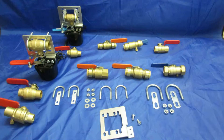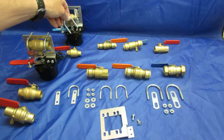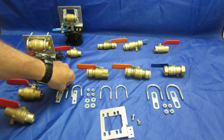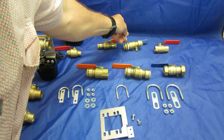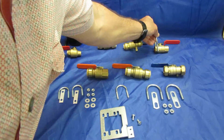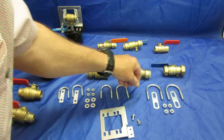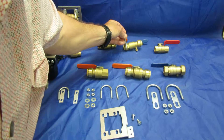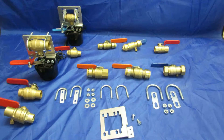You select the U-bolt that best fits. For the half-inch solder and first PEX, use the smallest U-bolt. For the second PEX with the larger diameter, you need to go to the larger size U-bolt. For the FPT, you can use the smallest again, but that larger one won't fit here.